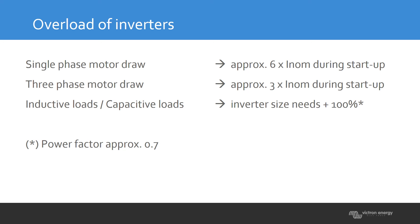The other way around: if you have a 1000-watt electrical motor, you need about 6000 watts of starting power to get it running. On three-phase, that's slightly better — a three-phase motor draws about three times its nominal power at startup. This means inverters handle three-phase motors better than single-phase ones, because three-phase motors already have a rotating magnetic field, making them easier to start.